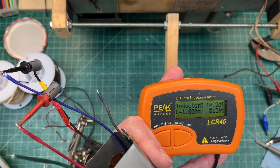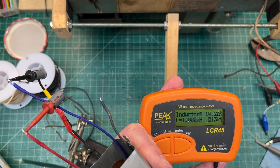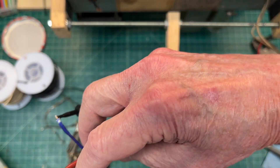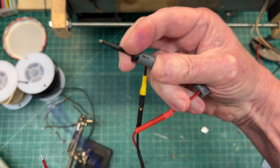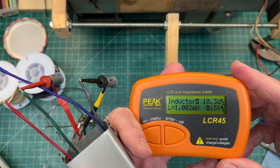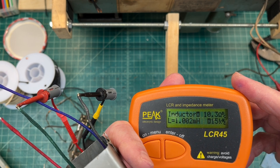You can see the measured inductance in the can — which will always shift some — so we're about 1 millihenry and 10.2 ohms with the new lead dress there on the primary. Let's look at the secondary — a good match there: 10 ohms and right at 1 millihenry as well.